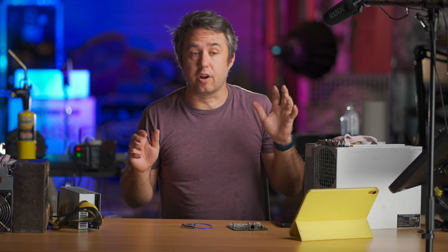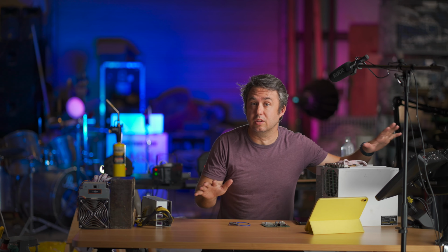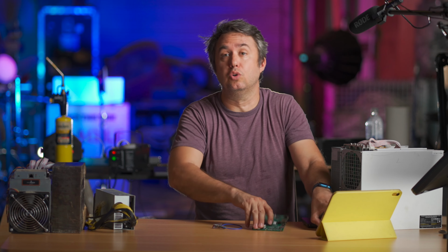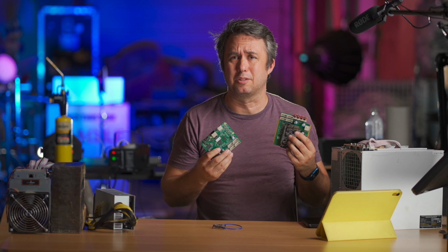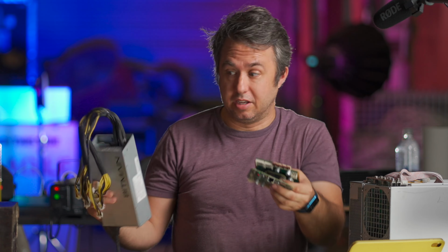This does mean that if you want to run a full S19j Pro on 120 volts this way, which you absolutely can do, you'll do that by getting your hands on 2 additional control boards. These are like $100 a pop, and 2 additional APW3 power supplies, also cheaply attained. You can get them through Musk Miners.